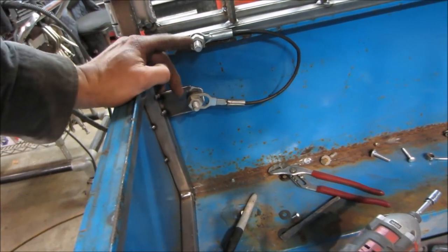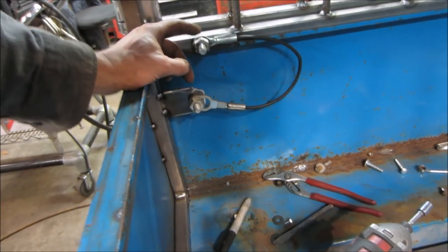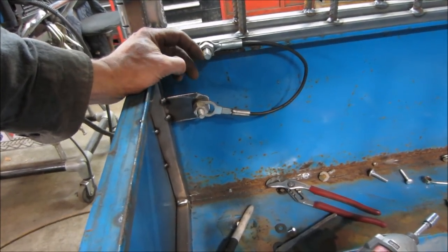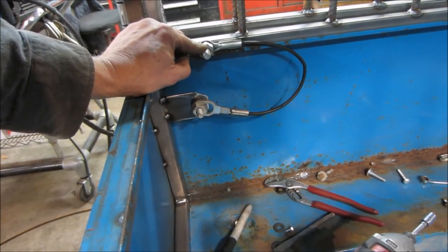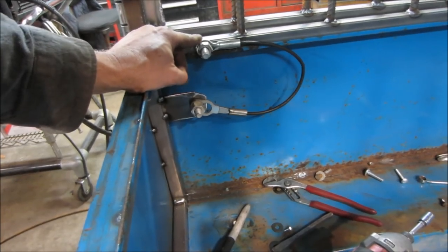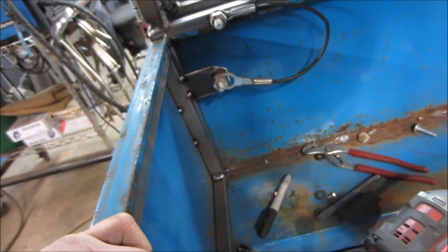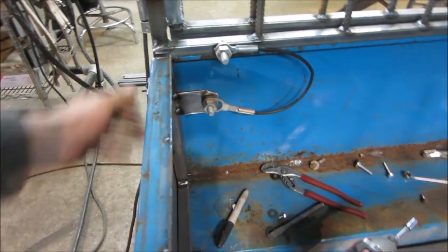So what I figure I'll do is I can weld them solid, run the nut in until we just got a little bit of play in it, and we'll just come back with the whiz wheel. Cut them off flush with the cutting wheel, and that'll be the diameter we want. Maybe take a little chisel or a punch, and we'll just give a punch mark to keep the nut from turning off. But if we ever want to take it apart, we still can. We just unthread it. So I need to make another one of those for the other side.